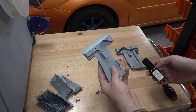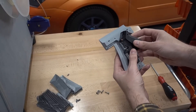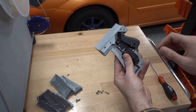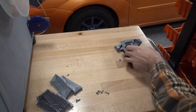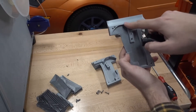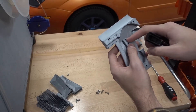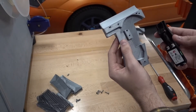Here they are printed, and as you can see it's exactly as we defined it. But as is usual when you're quickly designing something, it doesn't quite fit. There's a little bit of mismatch and we need more clearance up top — it's almost in there, but you can't really pull the trigger. I did try putting this together and it just binds up, so that's no good at all. So what I've done is gone ahead and redesigned just a little bit and reprinted. I've given quite a bit more room up here just by changing that to be an arc, and now that fits quite nicely. There was also a little piece on one side colliding with a piece on the other side — you'll end up with that kind of stuff and you just keep redesigning until everything works out.